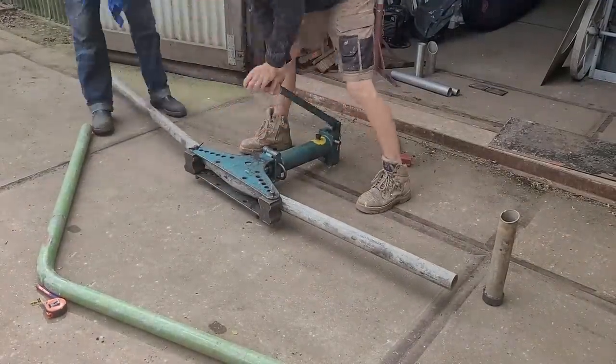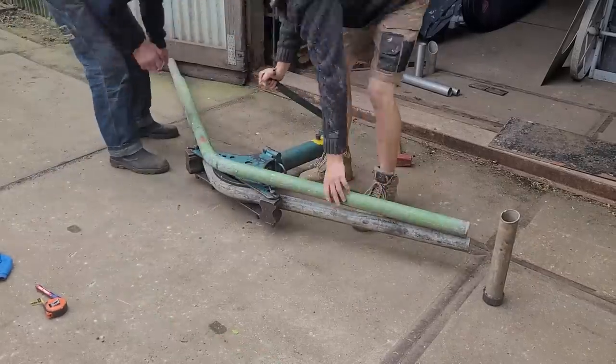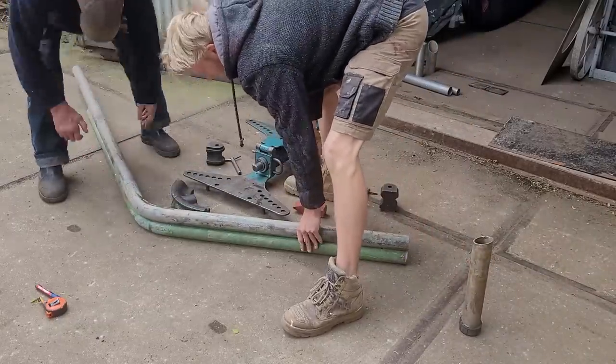The booms are made from standard 2-inch pipe, bent into the correct shape. Since the boom will be able to swing from port side to starboard side, this is always a cause for rust on the points of contact. So we're using stainless steel on all the moving parts where metal touches metal. This does mean cutting and welding a lot of stainless steel parts.